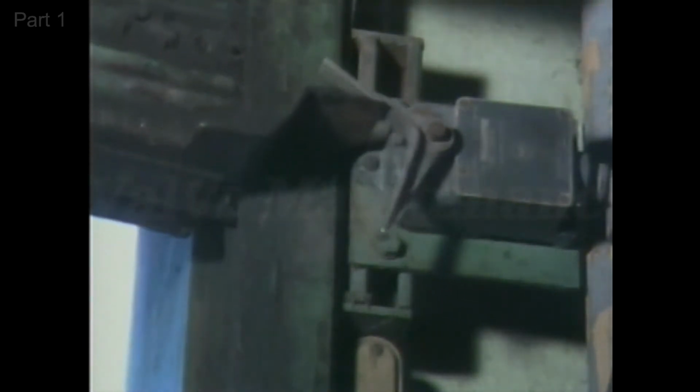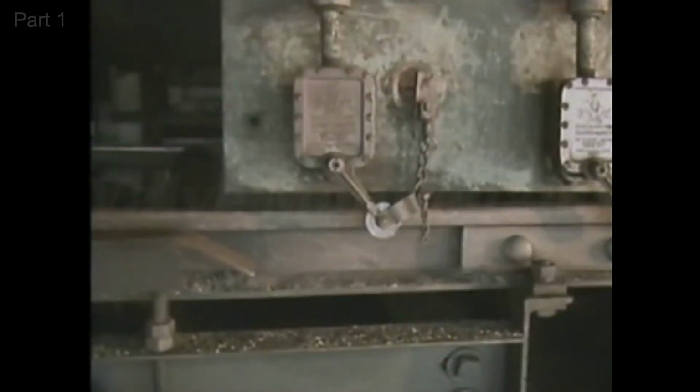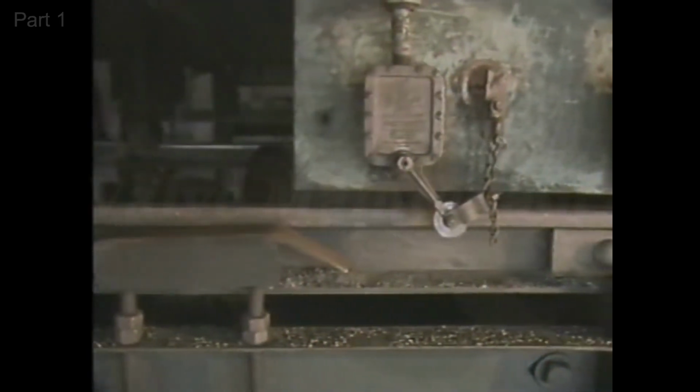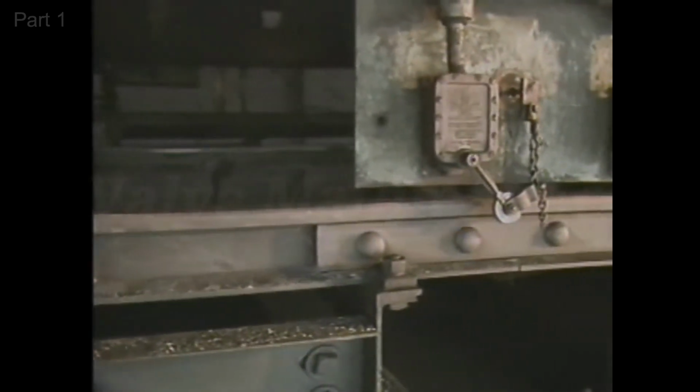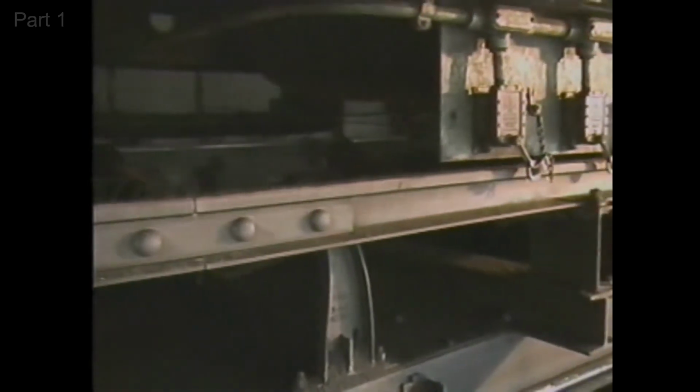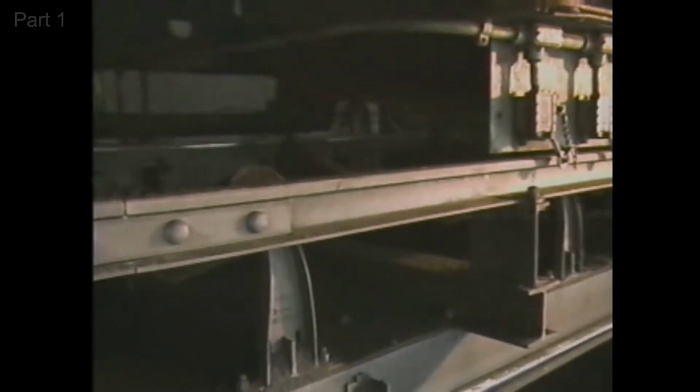Another commonly used pilot device is a limit switch. Limit switches are mechanically operated devices that open or close circuits when a mechanical mechanism reaches its limit of travel. This limit switch has a lever arm that's placed so that it protrudes from its casing. When the equipment being monitored reaches its preset limit of travel, it pushes the lever arm. The lever arm, in turn, activates the opening of one set of contacts, stopping the motor, and closing another set of contacts, which results in the motor operating in reverse.